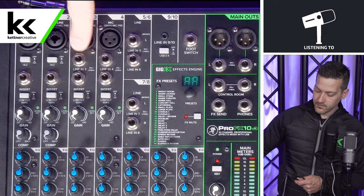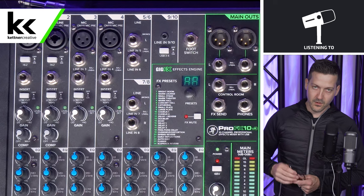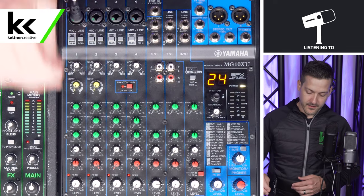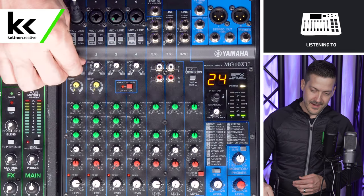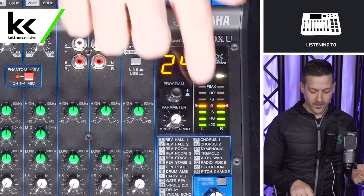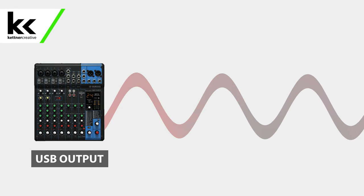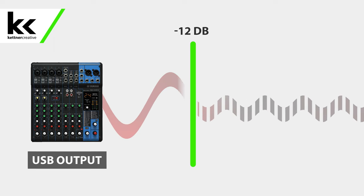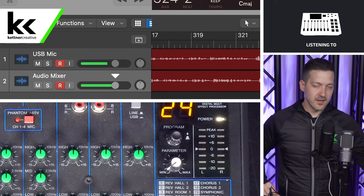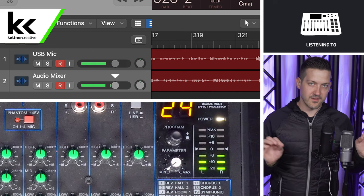What you're looking for is a line input — it says line in three — or one of these XLR combi inputs. I'm going to plug it in there. Next, we need to set up the gain. We're going to turn the level for this channel up to that triangle position, and now we can increase the preamp until we're getting a level around 0 dB on the meter. That's exactly where you want to be on an audio mixer like this. Most audio mixers set to 0 dB will bring the USB output down 12 dB as a digital-analog offset. Now if you look at the computer, you can see that we're getting a much healthier level — very similar to the level coming out of the Blue Yeti directly to the computer.